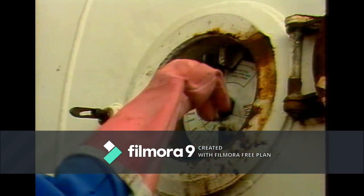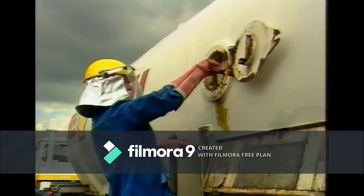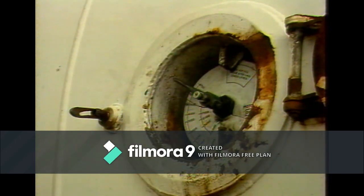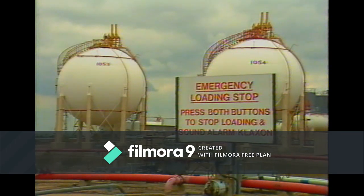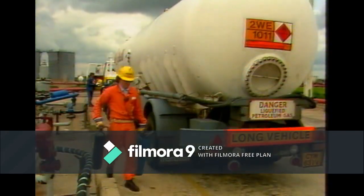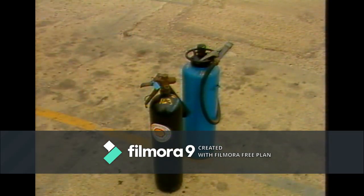The quantity already in the tank is measured by the level gauge to make certain there's enough capacity to take the intended load. The gauge has a pointer on its handle which indicates the tank contents on a dial. The positions of the emergency shut-off and the fire alarm should be noted. The depot or vehicle fire extinguishers should be ready to use, upwind of the loading point.